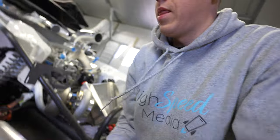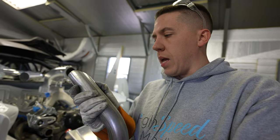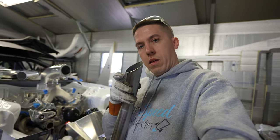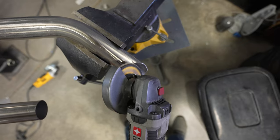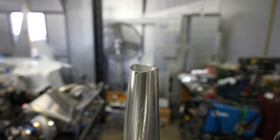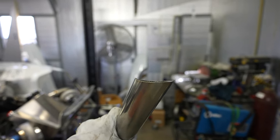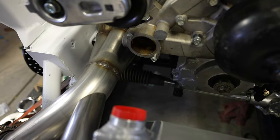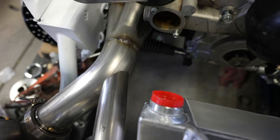I'll probably also take and cut this off maybe a little extra long so I can kind of eyeball it. But that's what I mean, it's hard, because if you get it too short, you pinch yourself into a corner. So probably get this fitting nice, then cut it, and then put my flanges on there, and if I need to shorten it to tuck it up a little bit better, I'll do that. Now hopefully you guys can see, that would have been the square cut, and now I have a little bit of a cope going on. Still need to work this side a little bit better into it. You can kind of see where it's starting to lay. Bring it over here and put it on the pipe — it's close. We still have some gaps, but I think I'm in the neighborhood.